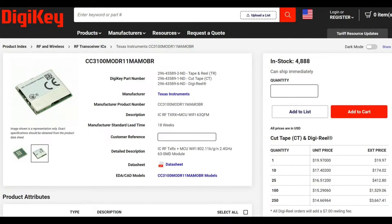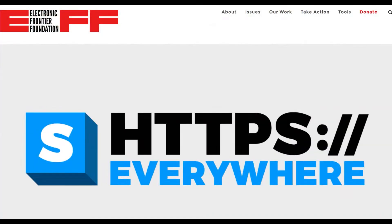The original CC3000 was very successful, so they came up with more versions like the CC3100. That one added SSL, HTTPS, and WPA2 — it added a couple of things to make it more useful. But they only added SSL 1.0, and you couldn't upload your own certificates — you only had like one certificate you could use.